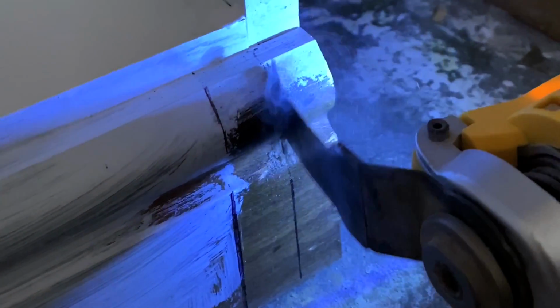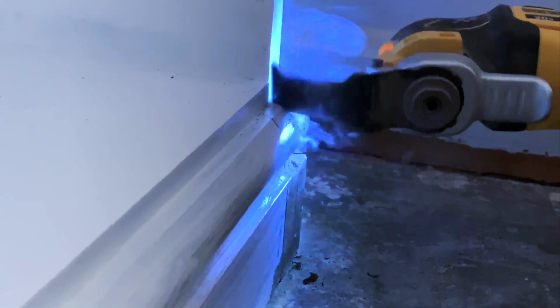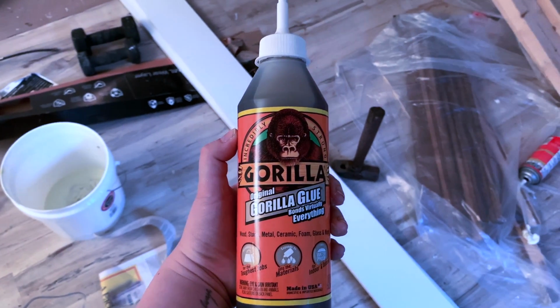When you add the wood pieces to the side of the units, you want to make sure that they sit in front of them to cover the side. This will give it a much more clean look. And at the same time, you don't want there to be any gaps, so you're going to want to cut into your wall base to make sure that your wood is right up against your wall. And also, if your shelving unit has wall base on it like ours did, you want to cut into that as well to make sure that it is really in there and flush with the surface.